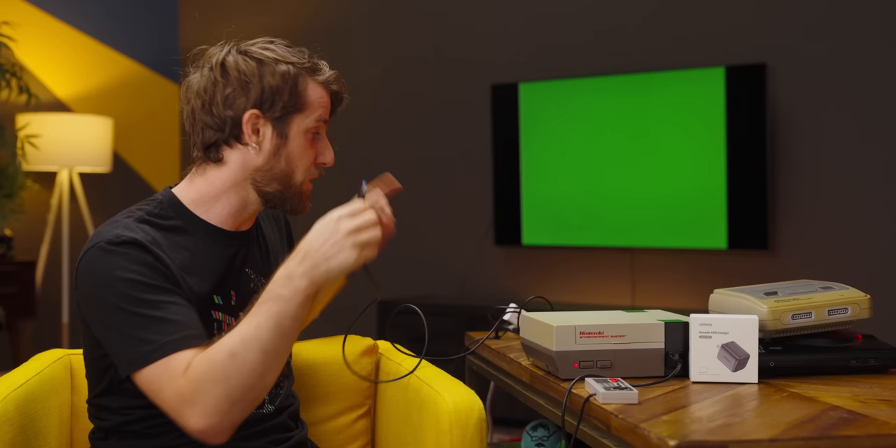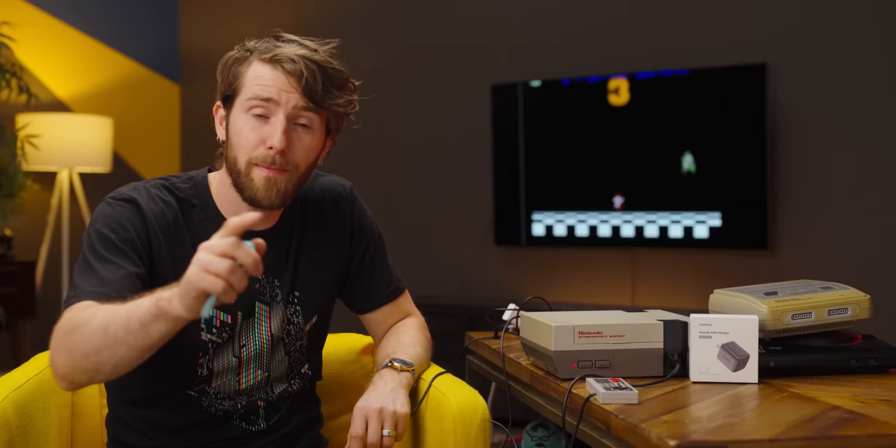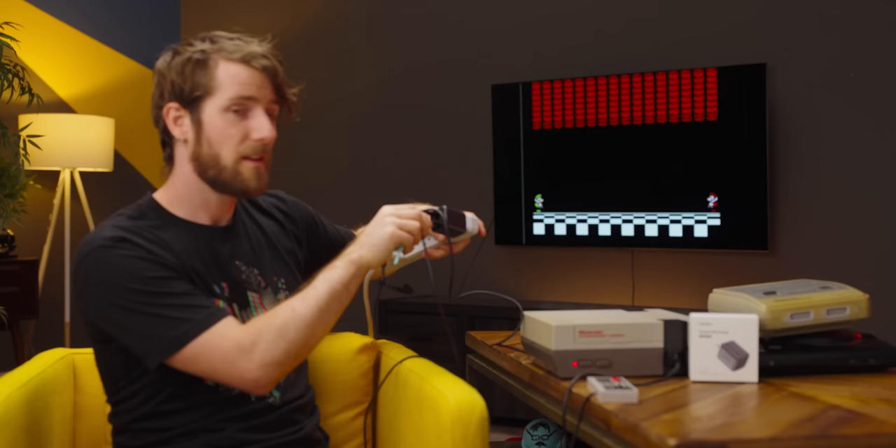The coolest thing about this is not only that we got rid of that giant sketchy power adapter, but that we were actually able to plug in two consoles to a single power adapter. And remember when I said power delivery has some flaws? It's extremely common for PD chargers, especially compact GAN chargers, to pause power to their already connected devices when a new one gets plugged in. They then perform a fresh handshake with every connected device. Short pause in power, and it's back. To be clear, this is a feature, not a bug — it helps ensure that you can't ask a charger to output more than its capabilities. Safety first. But it is a little inconvenient for devices like these that don't have a battery in them.